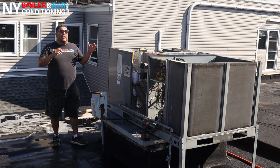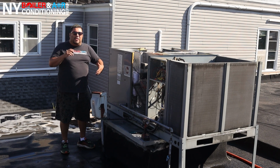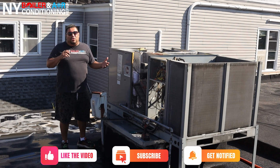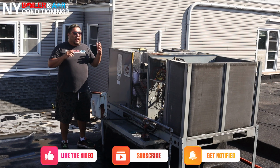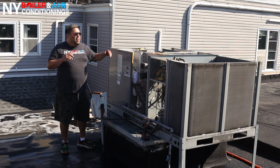Guys, it's very important to clean out the blower wheel because it collects a lot of dirt and lint over the course of time. What happens is it puts weight on the wheel, and it burns out the motor in the end. So if you want to save money, that's a good way to save money, and it's part of preventive maintenance that a lot of guys overlook. Clean out the blower wheel. It's part of the maintenance.